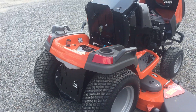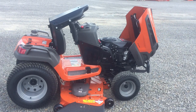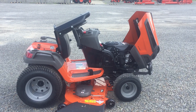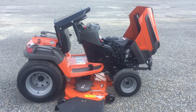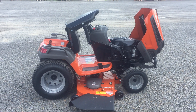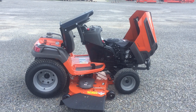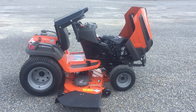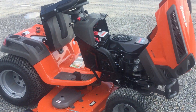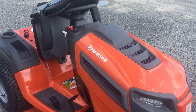It is a very nice tractor. This is a dealer model. Most of these tractors come with a 3-year warranty. They are all going to be a 50-hour setup for the first service, which is changing your oil and filter, greasing everything, checking your blades, and checking everything over on the tractor. It is always a good idea to take it back to the service center you bought it from so they can check for any warranty campaigns. Sometimes dealers will even come and pick them up.